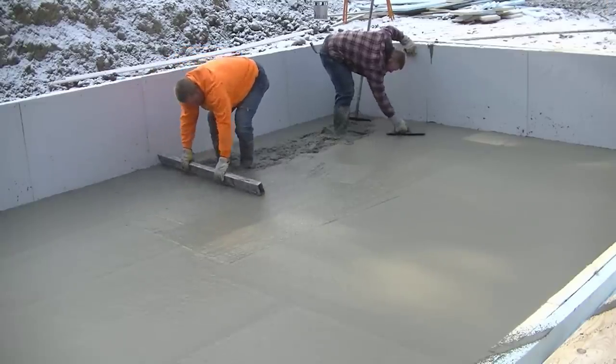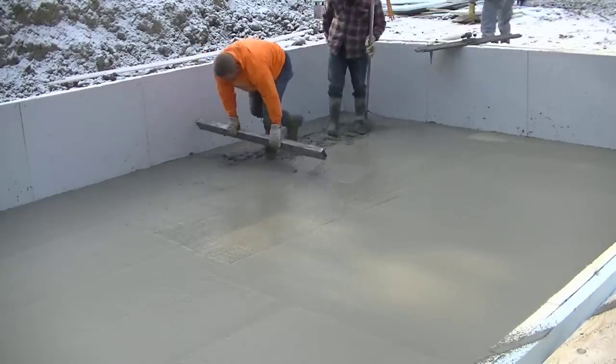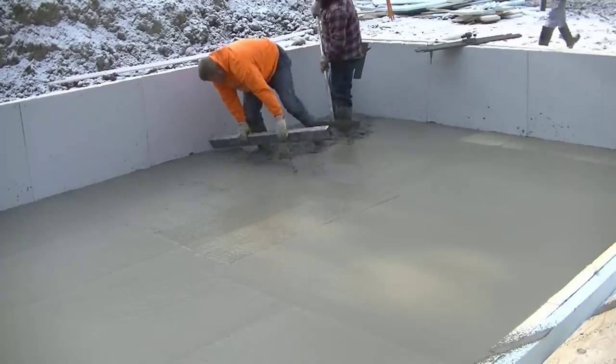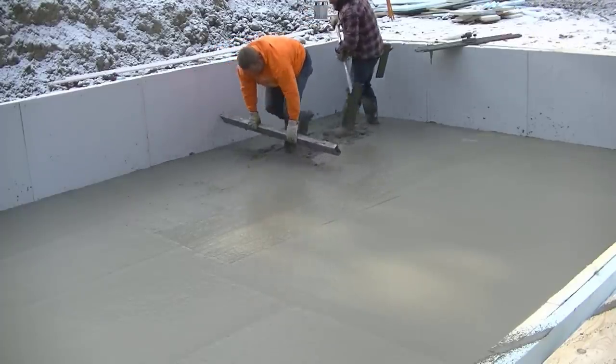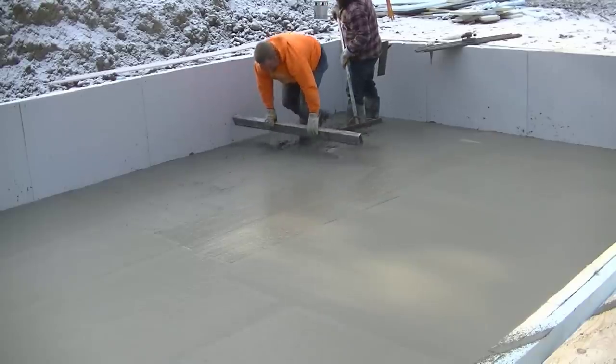But now look, see how he's bent over, kicking and pulling the screed at the same time? So if you screed by hand normally, there's just a whole different type of effort you need when you use that, especially that battery-powered one where it's so light.